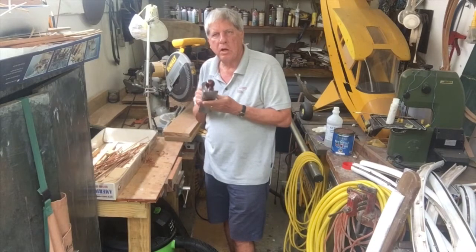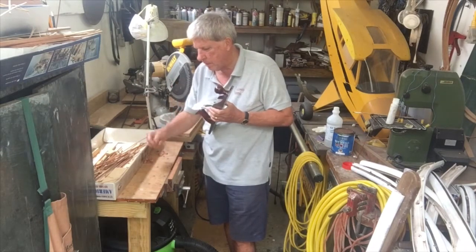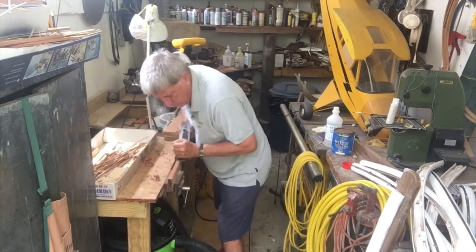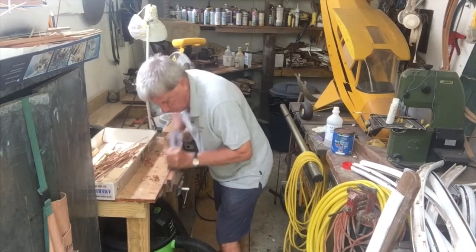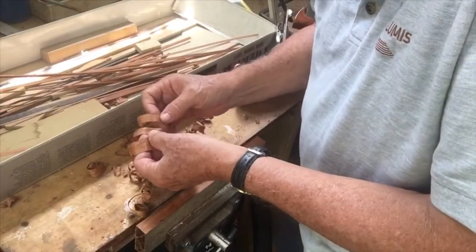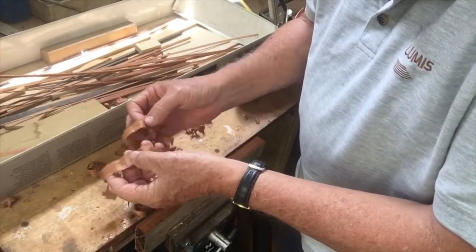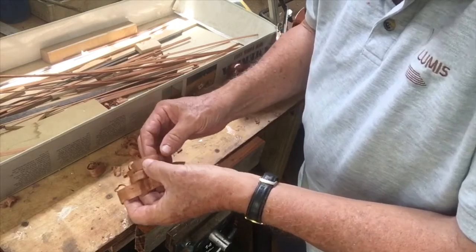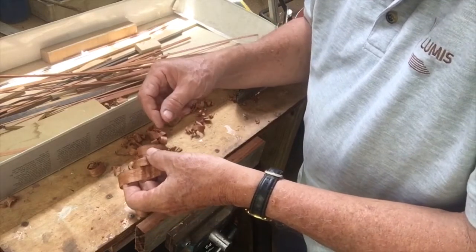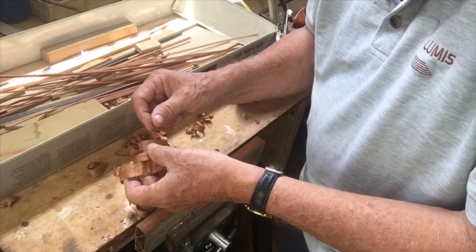You need a plane with a very sharp blade and a very fine entry, because you want to make the shaving as thin as possible. From these shavings you want to get some nice thin long pieces — the longer the better — because you want to make at least two, maybe three wraps on whatever you are using to determine the size of your hoop.